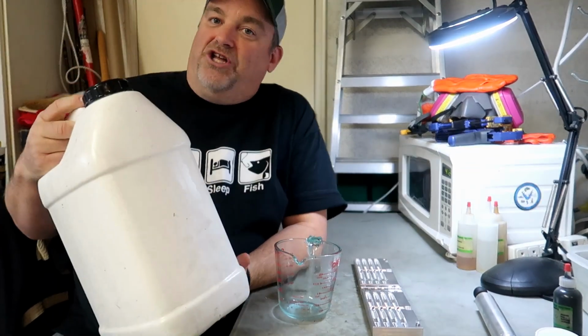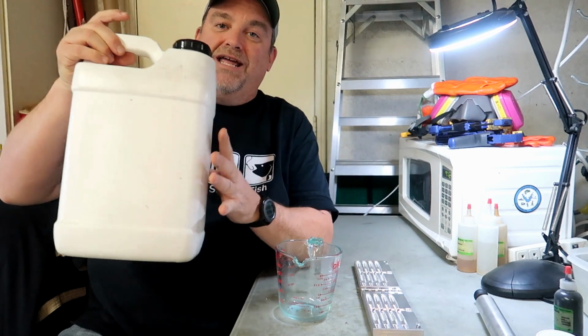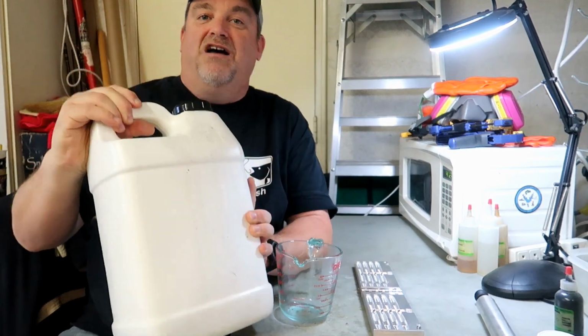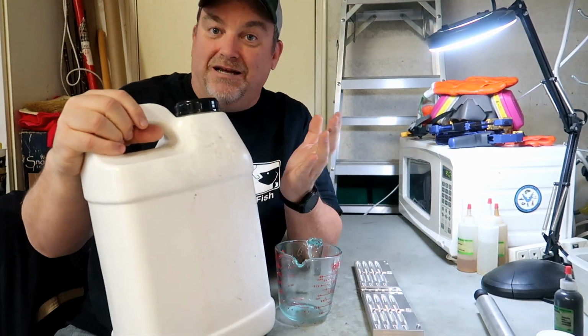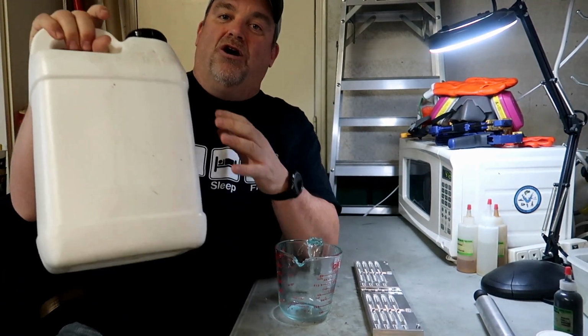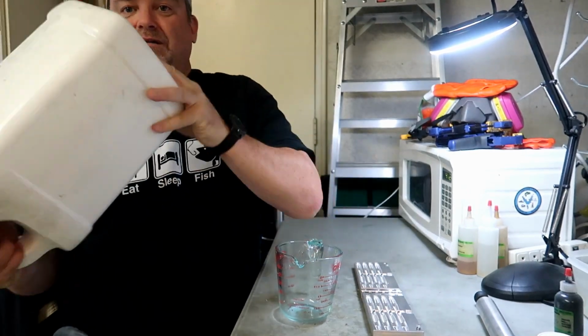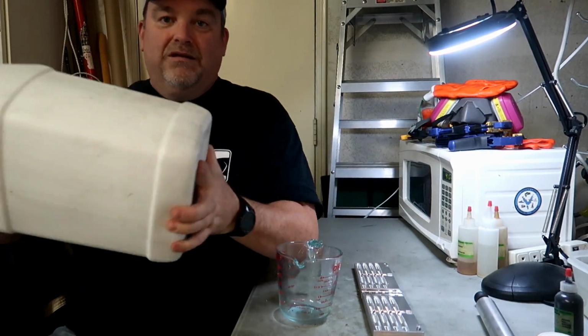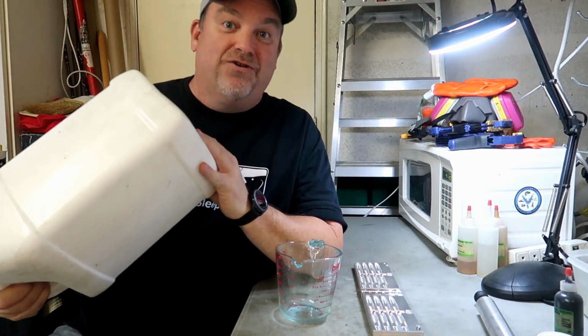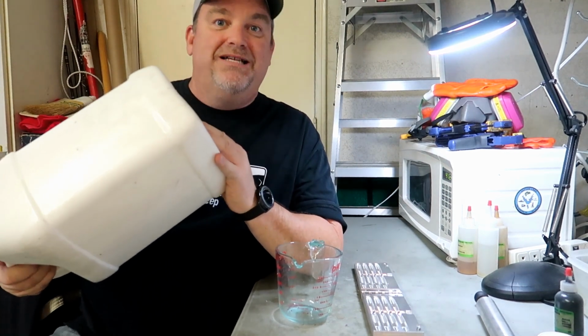You're going to take the plastisol, you got to shake the stuff up good. What happens is the hardener sinks down to the bottom. This right here is a medium recipe. You can get soft plastic, medium plastic, hard plastic, it's up to you. This right here is a medium plastic. But what happens is the hardener sinks down to the bottom and it just sits there. So you got to shake it up real good. And I'm going to go ahead and fast forward this because you don't need to watch me shaking it. I shake this for a good 30-40 seconds vigorously because I'm trying to get that hardener mixed in throughout the plastisol.